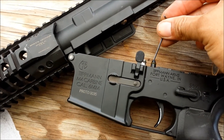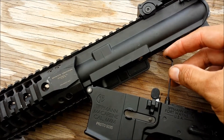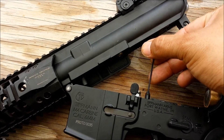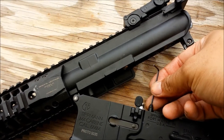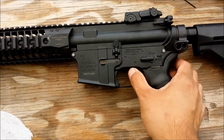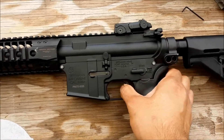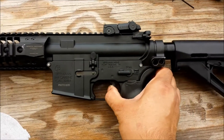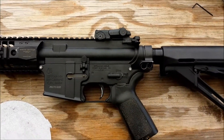To back down the rate of fire screw, you're gonna be turning it counterclockwise, or out. It only takes a really small turn — that was probably enough to catch everything in alignment. So reassemble the gun, we made a little adjustment on the rate of fire screw, and everything is in sync.